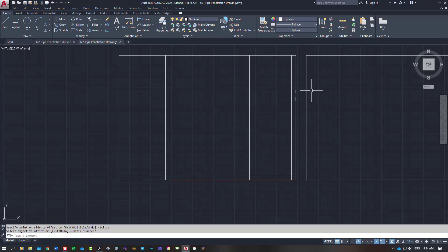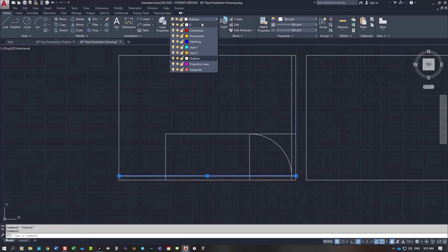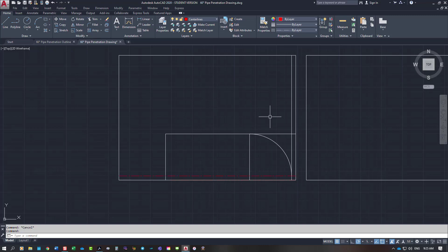That's what my pipe is going to be. I need to draw a circle on the end, trim that out, and keep those two lines. I'll trim this off at this point and on that end. This line on the bottom is the center line, because it's the center line of the pipe — I'm only drawing a half elevation of the actual base pipe which is 200 mil. From there I'll come along 50 mil.